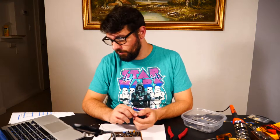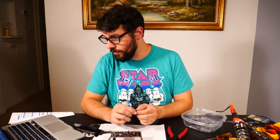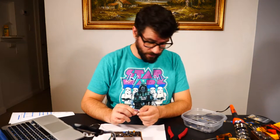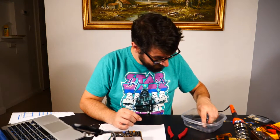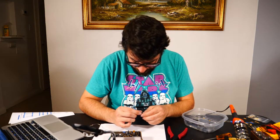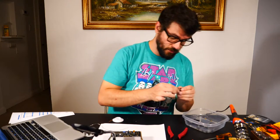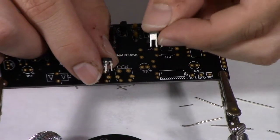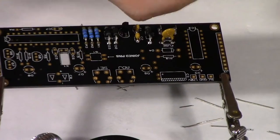In this section we're doing a couple of resistors, the IRFD220 MOSFET chip, then a diode, a couple more capacitors, an inductor, and the socket for our first integrated circuit. The one interesting thing about the MOSFET is that it looks very similar to four other units on this board. The only way to tell it apart — besides reading the tiny text — is that the pins on one side are connected, where on the other components they are not.